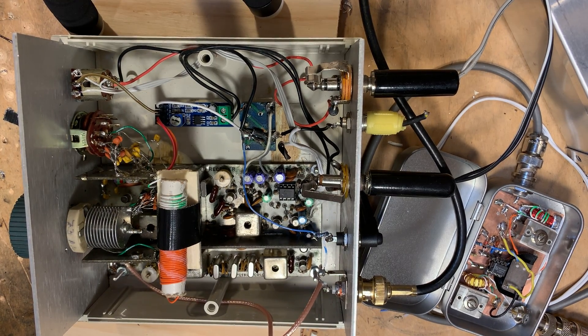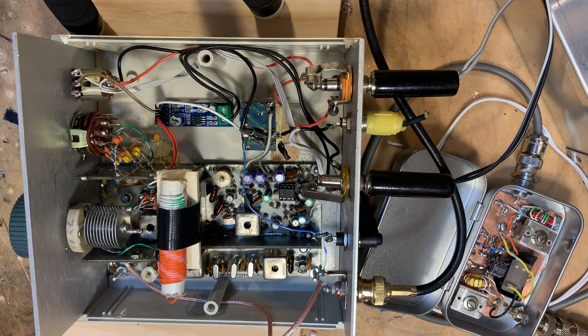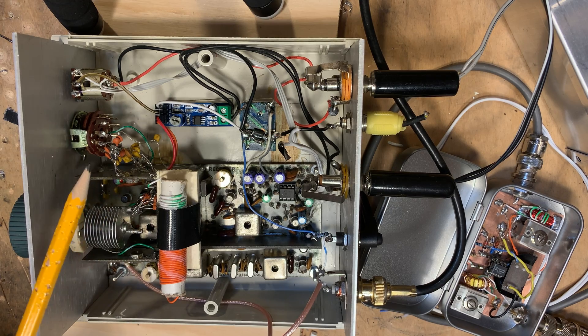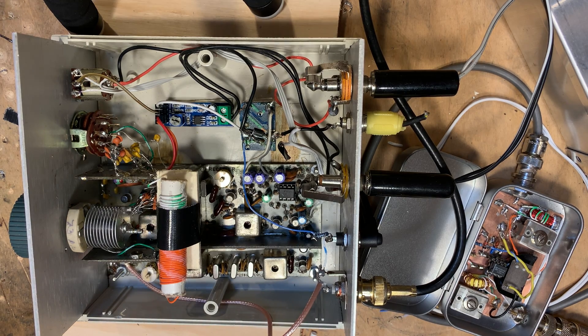I ran it to the NE602 mixer, then I had to move the VFO. I figured I needed it to run from 18.835 MHz to 18.890 MHz — that was easy, I just fooled around with some switchable caps over here to change the range of the VFO. This mess of capacitors down there was just to change the range — I needed about 55 kHz to cover the 17 meter phone band. It's come together pretty well using this big air-core coil on a coat hanger tube.